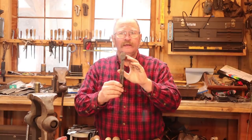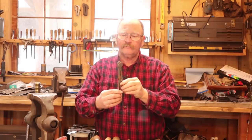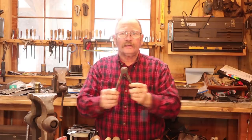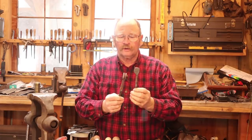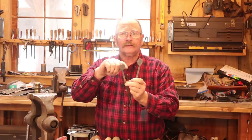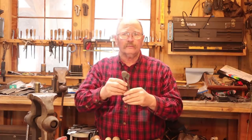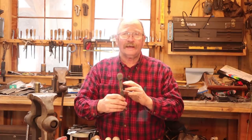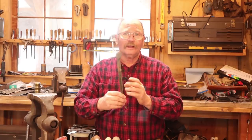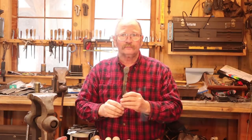In the last video we did the fitting to get the head of the dividers all assembled, and this doesn't really pivot nicely — it kind of hangs up. There's still a little bit of filing to do, but they do go together and they are snug, so I'm just going to do enough to clean it up, round up this head to make sure it has clearance as it swings, then we'll drill a hole and assemble them. After that it's largely down to filing and fitting and adjusting, and there will be a lot of that to do once we get these things riveted together.